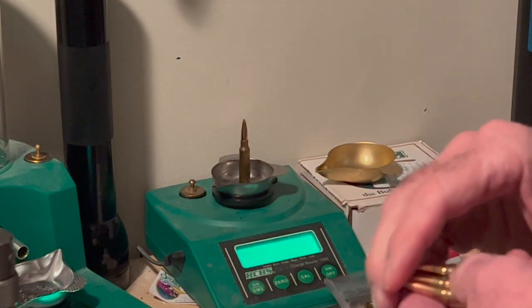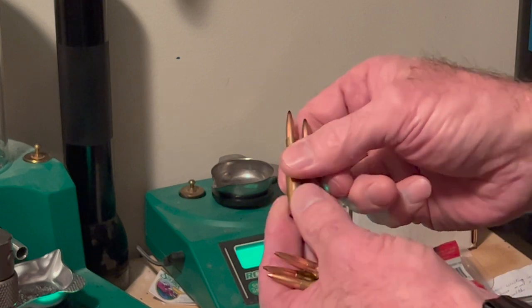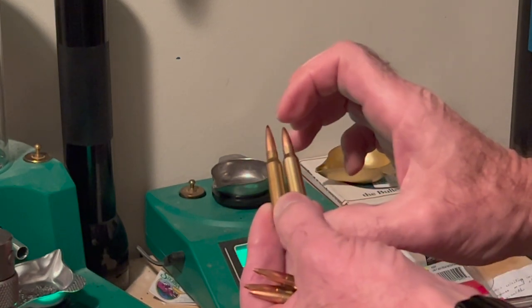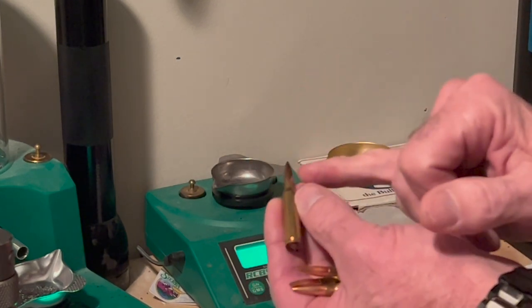All four of these that we loaded — this one is 2.013. That's just components, and that's what it looks like. If you're new to the sport: for 77 grain bullets, we measure overall length for magazine length. For the 80 grain bullets, we're measuring to the OGIVE — that's what's going to contact your lands. That's the process I use for loading my 600-yard ammunition.